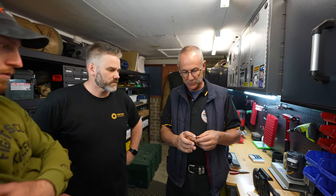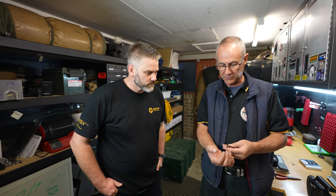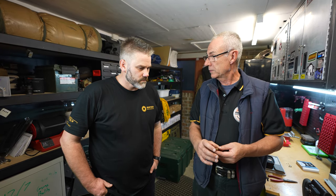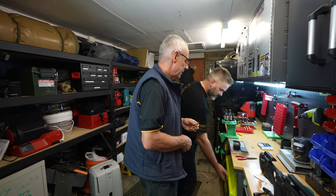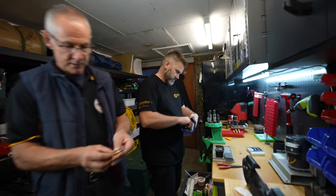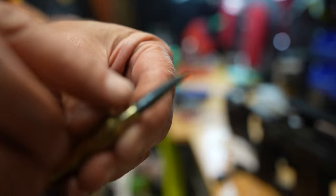Because we're using a lathe turned ball that's very consistent in its form factor, we don't need to use an ogive comparator, we just need a pair of verniers and deduct 1.27 millimetres. Did you get that? Can you see that? It's only fairly faint, but you can see the engagement of the lands at the base of the ogive.